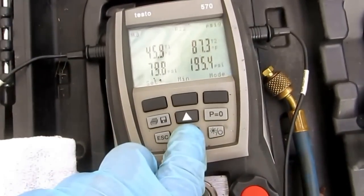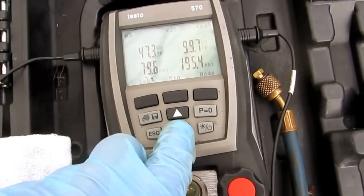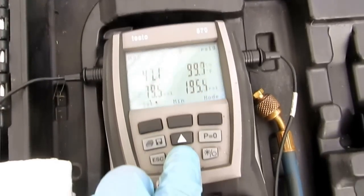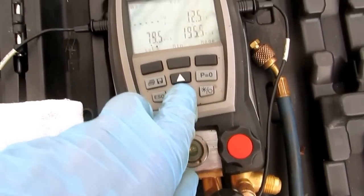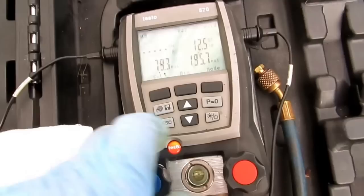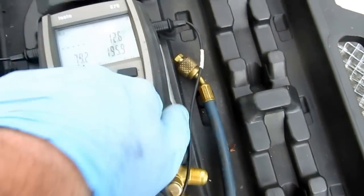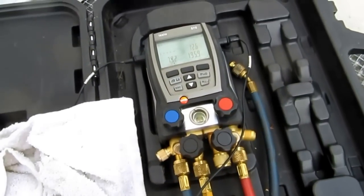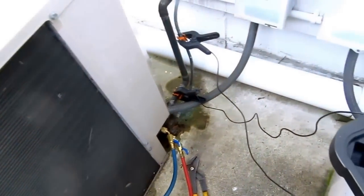The suction line is coming back at 45, it's way cold. Evaporator at 46. If I get to zero it'll start coming back. People are starting to show up here — unbelievable. I'm gonna dump a shit load out of this one. It's flooding back.